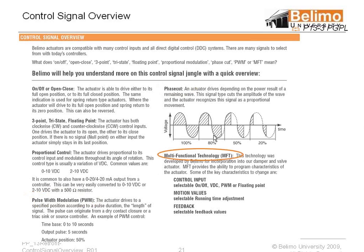Multifunction technology is a Belimo exclusive. What it really allows you to do is change any of the input signals to the signals I just spoke about. So we have the ability to talk to anybody's control system through multifunction technology. Do you really need to use it all the time? No. We have the SRs which are 2 to 10 — or spring return if you paid attention at the beginning of the training. But MFT allows you to do a lot of different things on an application.